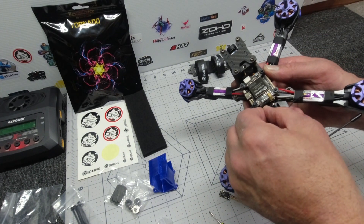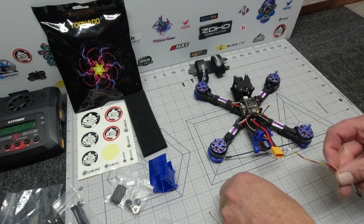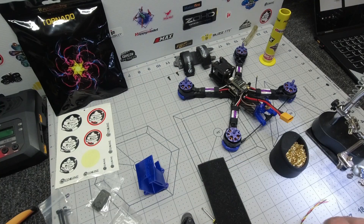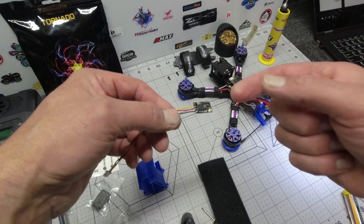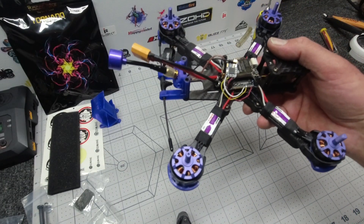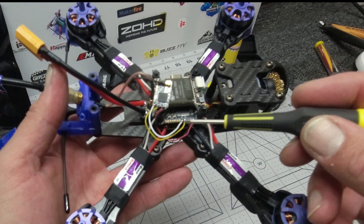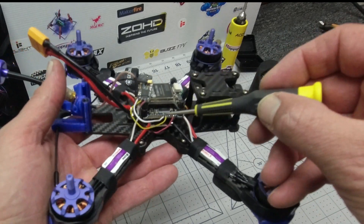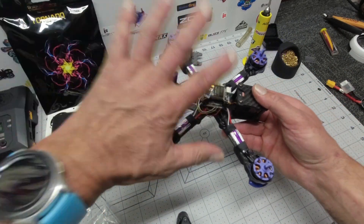With the plug-and-play version, if you don't have a receiver, Eachine kindly provides you with a receiver plug. It's just a matter of hooking that up to your TBS, plugging it in, and away you go. It's pretty straightforward — ground, five volt, and your SBUS wire. I'm using a TBS Crossfire with my five volt and ground on the side, then RX and TX for UART4, which is roughly to the center of the stack. A quick test with my radio shows it's paired and talking properly, so let's finish the build.